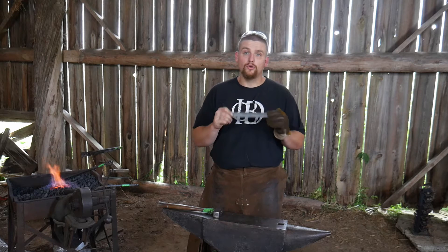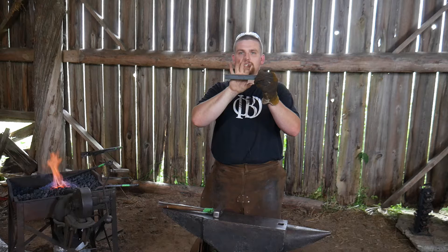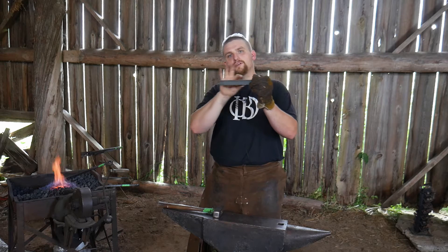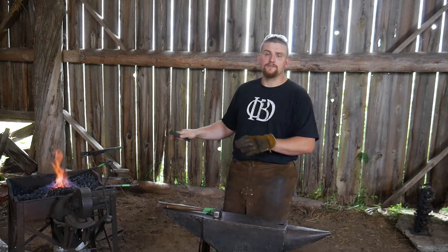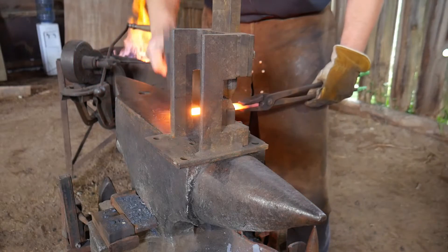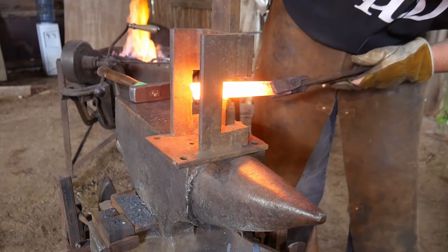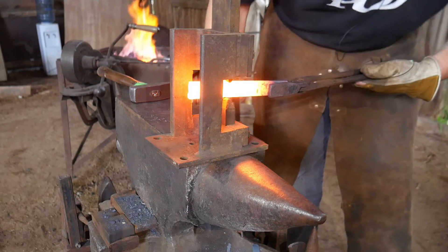Now we're going to draw down between centers - we're going to segregate the material on the front and back on both ends of the leaf, and then forge out the space in between. Without further ado, let's get to the forge. I had that piece a little on the hotter side than needed for this marking stage, but that's okay, we'll get that set up.